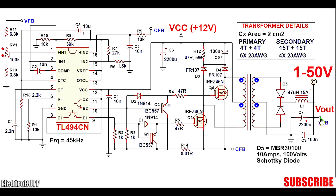The output voltage can be adjusted by potentiometer V1. By changing the position of the wiper of the potentiometer, you can alter the feedback voltage to the error amplifier at pin 1, allowing you to set the output voltage anywhere from about 2.5V to 50V as desired. This power supply has buck-boost capability — with a 12V input you can obtain a lower voltage down to about 2V or a maximum of about 50V, which should be quite sufficient for many DIY projects.